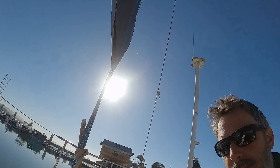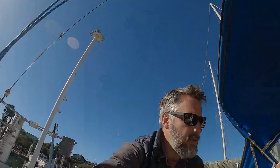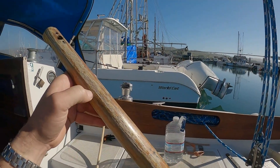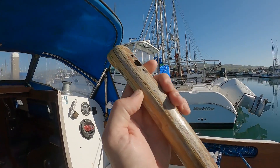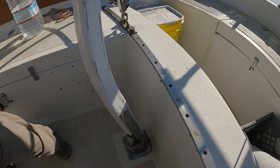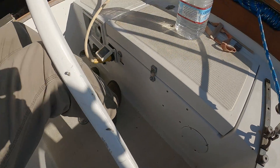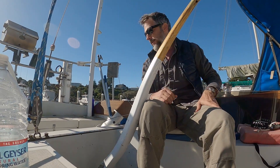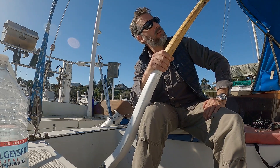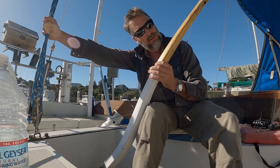So I think that's the plan. My tiller needs some love — I'm going to take it down now and show you what's up. As you can see, it's just pretty dried out and whatever varnish was on there has cracked off. I think the best thing to do is take it off and take it somewhere I can make a bigger mess and just sand the thing down. I don't think I'm going to go with varnish — I think I'm just going to go with the same kind of teak oil I'm using on everything else, and just maintain it better. Maybe make a cover for it so that when it's not in use I can slide a sun cover over the top and tie it up here — all covered from the sun, because that's really what does it when you're sitting in the harbor.